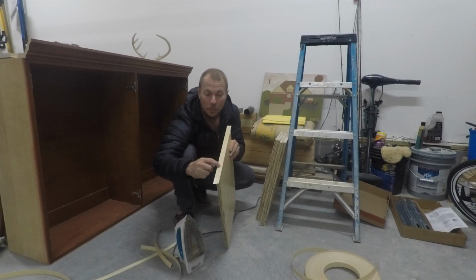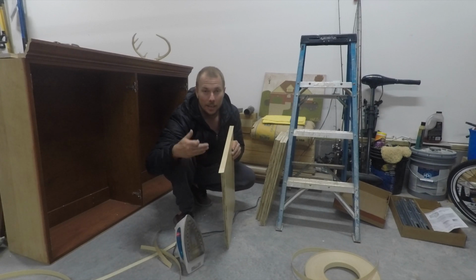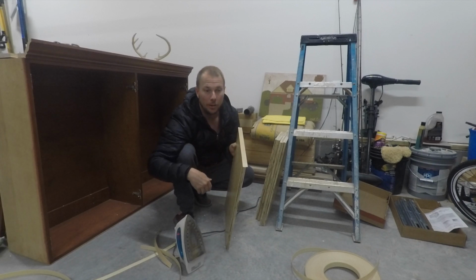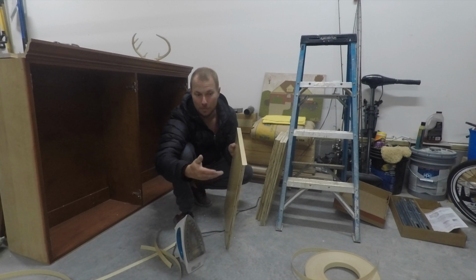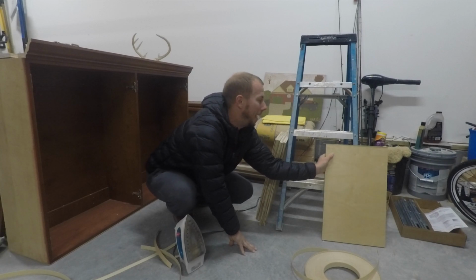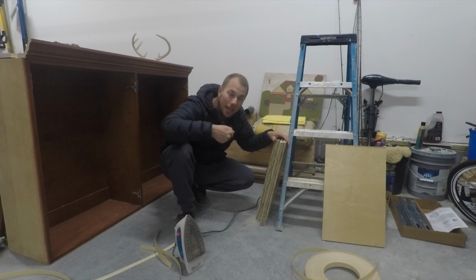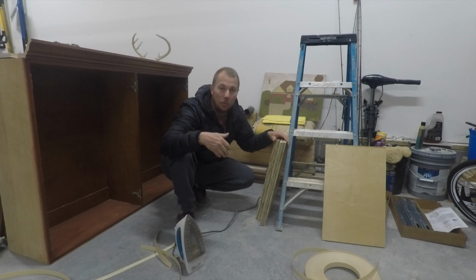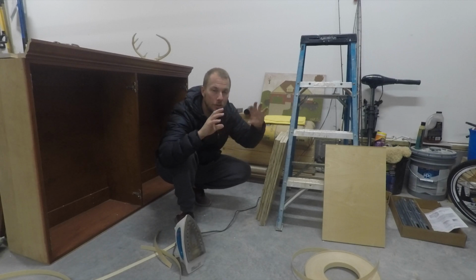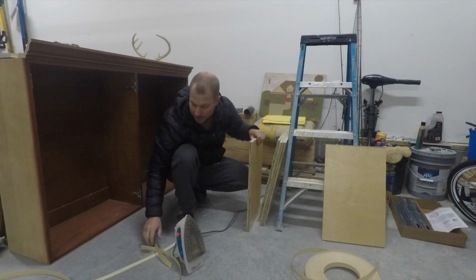We will sand the front of this because this piece is gonna be white like the trim in the house. So we'll spray this edge banding with the ML Campbell product, the Stealth or the Magnamax. We'll spray the white that matches the trim, and the one that goes in my office, we'll scuff it up, and we're going to spray it with a crystal, also by ML Campbell. We're going to spray it black because, like I told you earlier, the doors, everything's going to be black with a rub through, so the edge banding will just be a solid black.